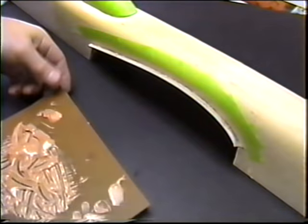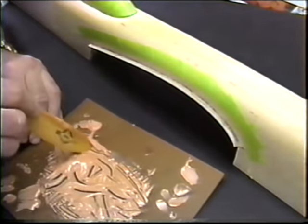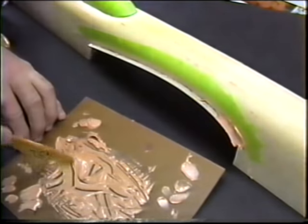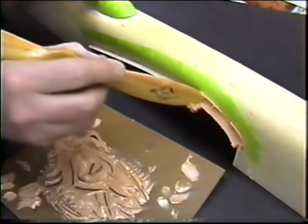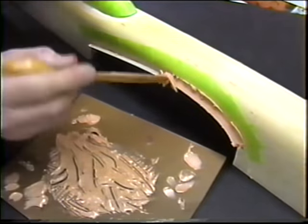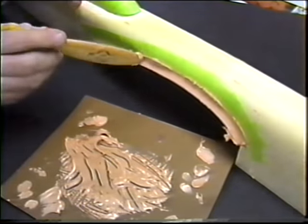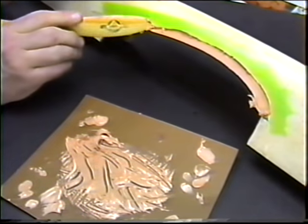One thing that always seems to help with this material in particular is, once you get the fillet made, get it up by a heating vent. The heat seems to let it cure a lot better than if you just let it sit in a cold cellar. And if it starts to kick off, obviously just junk it and mix up another batch. Actually, I mixed about 3 times the amount I needed here.